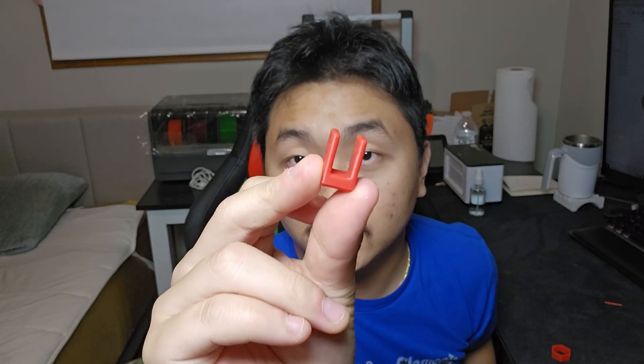So for me, when I print vertical things like this I tend to make the circle diameter a little bit bigger. Same thing for this piece — printed upright, the circle fits the filament really well. This piece printed flat with the circle going up vertically has a very small circle — it might be 1.6 millimeters even though I initially modeled it as 1.9 millimeters. The 3D printer material expands and the layers don't really stack perfectly on top of each other.